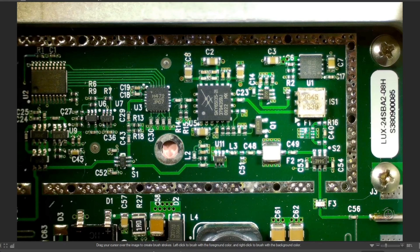On its way, the signal can go through F1 and F3, which are on the transmit path — those are bandpass filters. On the receive path, there's F2. Those are interesting things. You probably know more than I do, but it looks fairly straightforward and interesting. You just need to know what all these parts are.